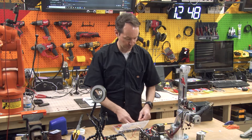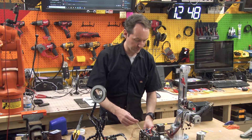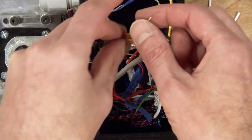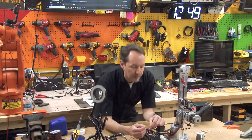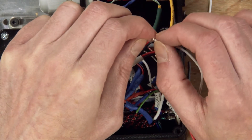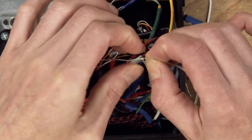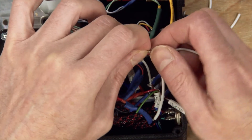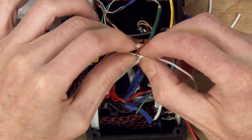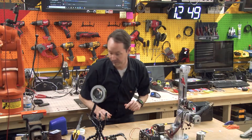We're going to use yellow heat shrink here — we just need the one piece for this joint. Come back around with this, bring it around a couple times and kind of lock that into place. That is not what I would consider a high quality rat tail splice, but I'll consider it an acceptable quality rat tail splice. And now we've got some goop — a big goop.